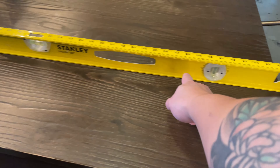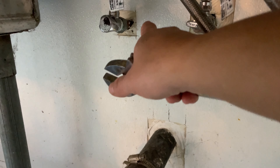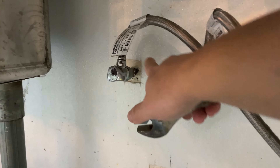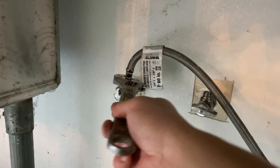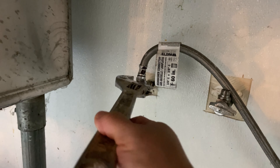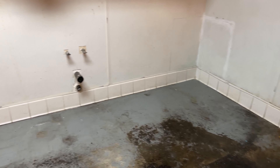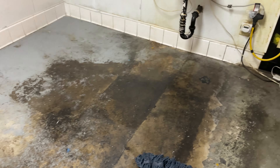Let's take the sink out — take out all the screws and make sure you turn off the water. Use a marker to label hot water so when you put it back you know which line is which: black mark for hot water. Detach the lines — I mark the hot water line right here, so it saves time when putting it back. You know which one is the hot water line.